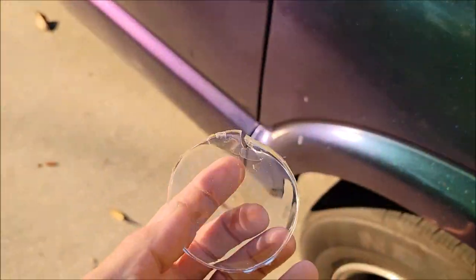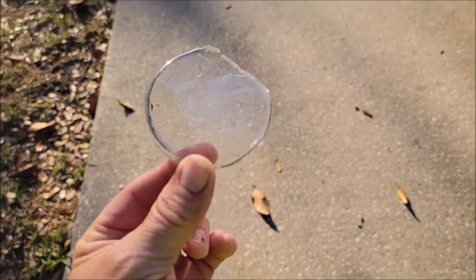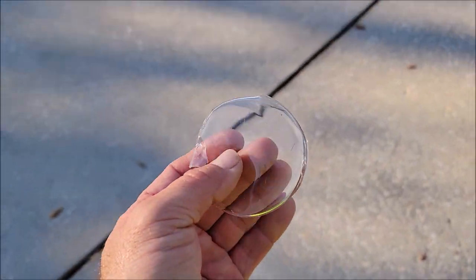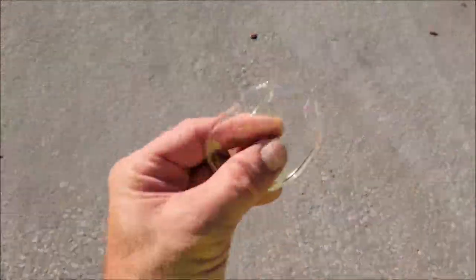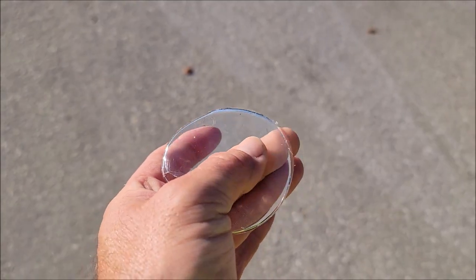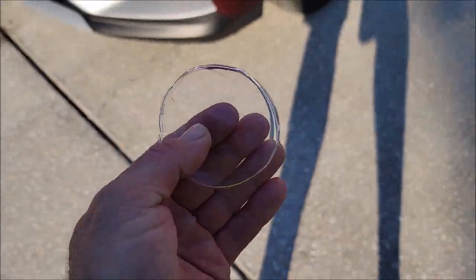So this right here with those pearls in it — I put a little bit of the actual product, Versacote 13, in a cup and let the solvents degas, so what was left behind was the actual product. This is what you're dealing with. The edges are quite thick, but the center is roughly what one coat would be as far as thickness — you get about six mils out of one coat.